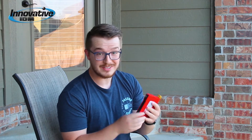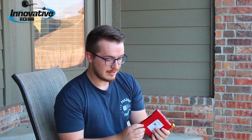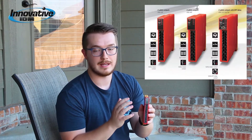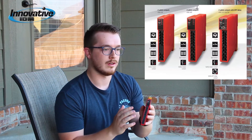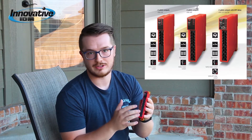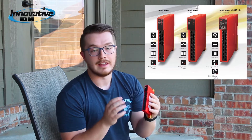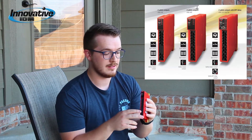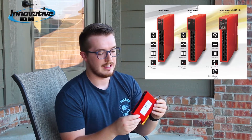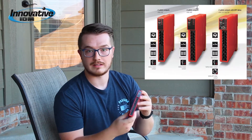There's a lot packed into this — 17.5 millimeters — and you get two safety inputs. This is the standard model 201, so you get two safety inputs that can accept dry contacts, light curtains, safety scanners, or something transistor-based. You also have two safety outputs. There are other models where you can get up to four safety outputs, and one model where you can get a timer delay function.